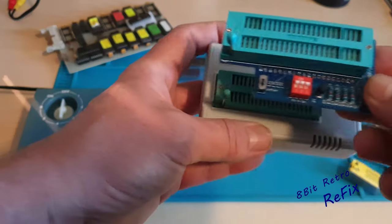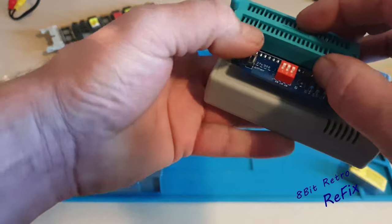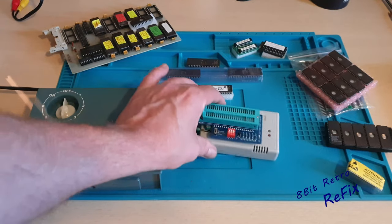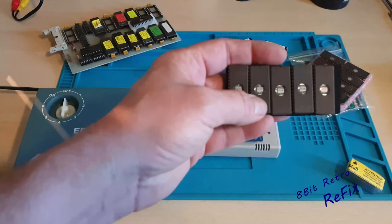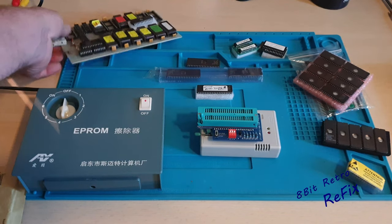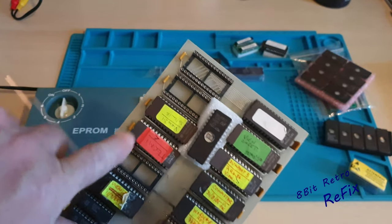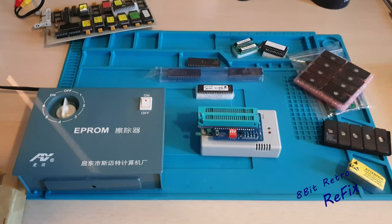So I'm just going to pop that back into the unit now. Just watch when you put them in - make sure that all the legs are in first, and down she goes, lock it in. So I've actually built that up now - that's us set up to read and program these chips. The other thing - everything you read about these chips mentions the notch at the top. Make sure the notch at the top is in the right place on the socket, make sure the notch is the right way around - match the notch up. You're told this over and over again every time you go about programming these chips.